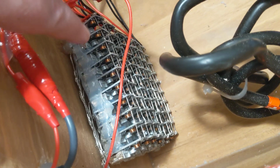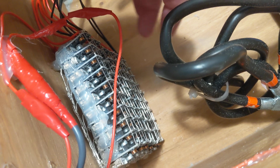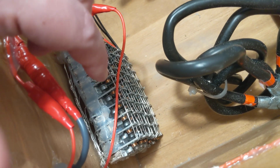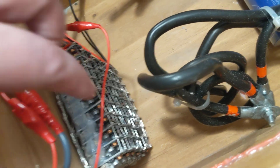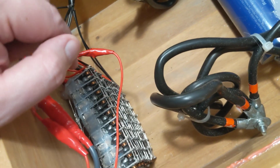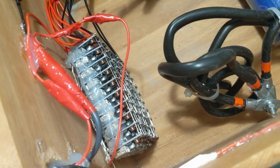What it actually does is, as these are running, if the capacitors have enough voltage to be able to supply enough current, then some subset of these, based on their PWM cycle, will actually be running together, and other ones will not run at all. They will completely miss the cycle, because they'll detect and say, hey, the voltage is already at 5 volts, I don't need to run this cycle. But some subset of these will work. And then as the voltage decreases, less and less of these will work. And then when it gets down to a few of them, they will slowly decrease their own PWM cycle until there is completely no amps left coming out. But the point is, this does work to be able to charge a phone.